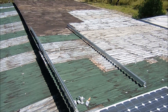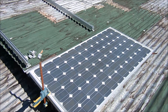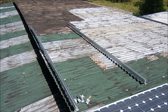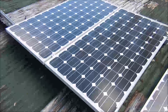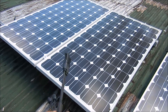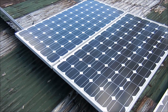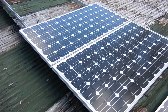We're going to move that and put a couple of 190 watt panels in parallel. We're going to leave the 150 watt one to charge an old car battery, which I'll use just to transfer water from the 1000 litre pod to the caravan. I've got two 190 watt panels in position now. I've got these parallel cables so I can connect positive to positive and negative to negative and wire these two solar panels in parallel for the charging station.